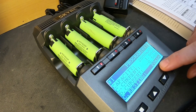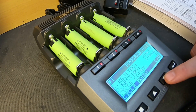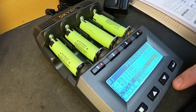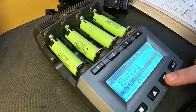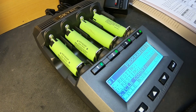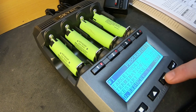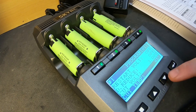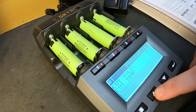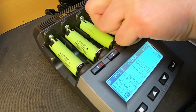Reset after charge, resting cycle count. Here you can actually test up to 99 different cycles — you can cycle test them 99 times. Target voltage, termination, restart voltage, discharge reduce, cut-off voltage 3V — this can actually be a little lower. Cut-off temp 45°C — that seems reasonable. And here you can change the program name — let's change that to 'tested cell'.